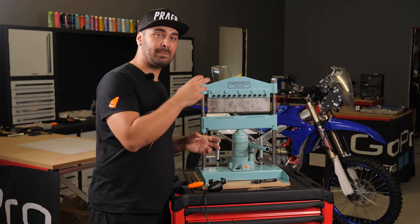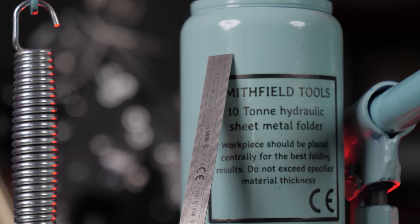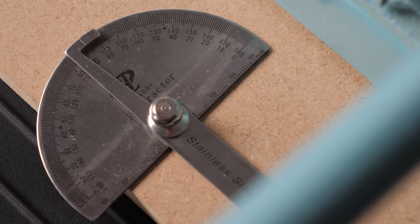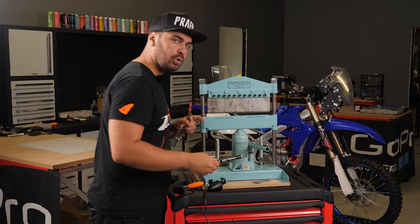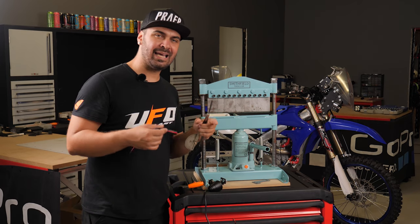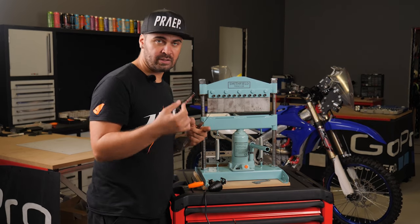While working with this metal bending machine I suggest you always use three tools: a simple ruler, a goniometer to check the angle and achieve the exact angle you want — because we don't have any display to adjust precisely — so we'll need to do trial and error. Once we get used to it, we start being much quicker and achieve the bend we want faster.